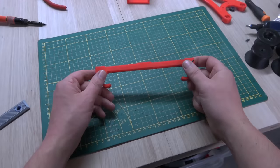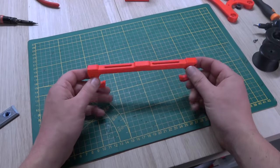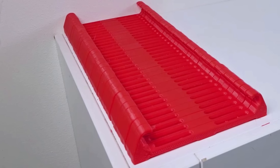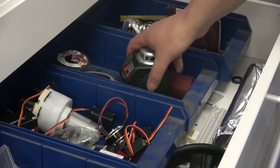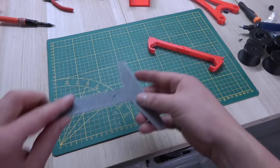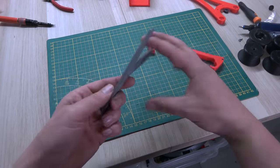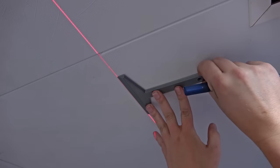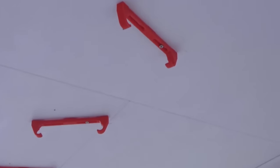First up, let's start with mounting the X axis rail brackets. Because my workshop is weirdly long and narrow, we'll need to mount quite a few of these. To ensure our brackets are perfectly aligned, let's fire up the line laser. To make marking the holes even easier, I've designed and printed this tool which aligns with the laser line, ensuring our brackets will be perfectly positioned — and not end up misaligned.